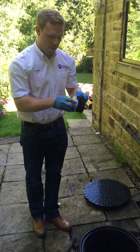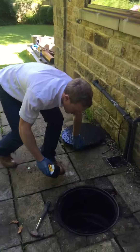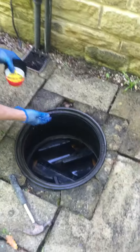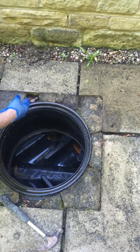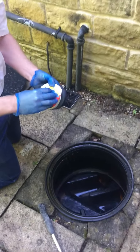Take your valve and make sure it's facing upwards, hinge to the top. Select the inlet chamber — for this specific one it can be on the bend, but ours here is on the straight. It could also be fitted on the bend due to its egg shape. It also stops smells and any rodents or insects from coming up the pipe because it has a steel flap.